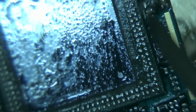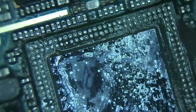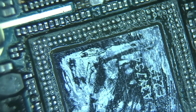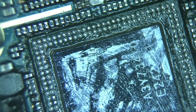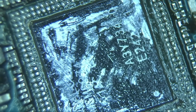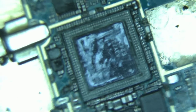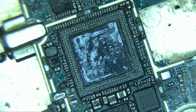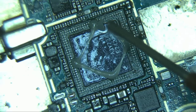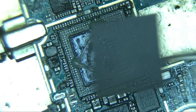So we are going to do some final preparation of the top joints and get them ready for the installation of the new processor. We apply some new fresh flux, but not too much because we're going to have to keep the top chip from moving while trying to hit it with hot air.